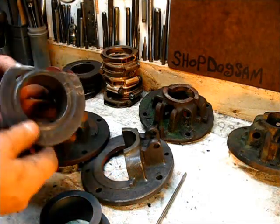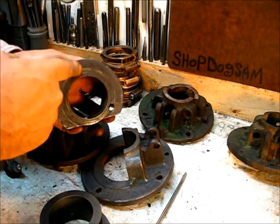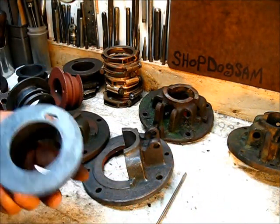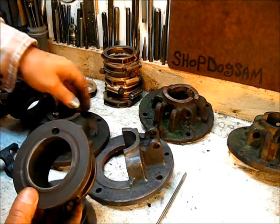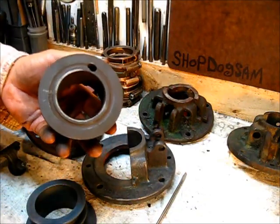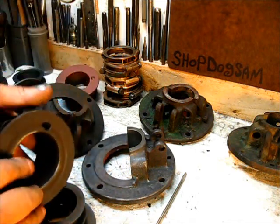This one here has been broken — easy to break these. The reason I laid it out is so you can see this ring where that hole is and the half-circle wall around it. It's quite a common occurrence that those wear like that. What happened is the pin got bent to an angle where it was rubbing on the back of the housing, and at that point this engine never did govern after that because the pin was holding enough pressure that it never moved. You can see how long it ran ungoverned to wear that groove in there.